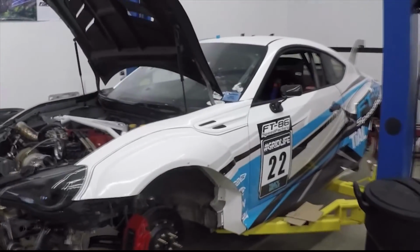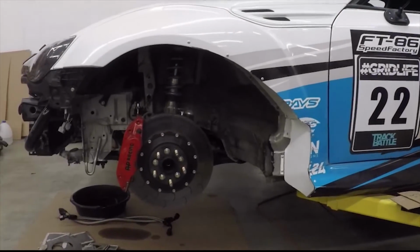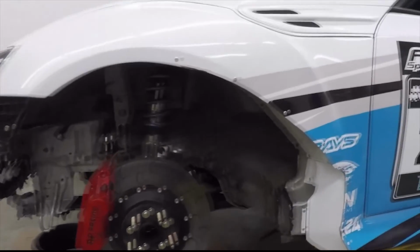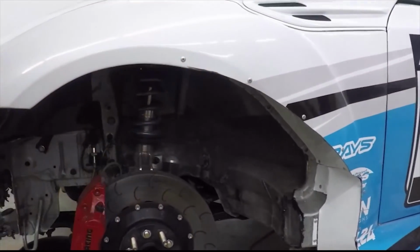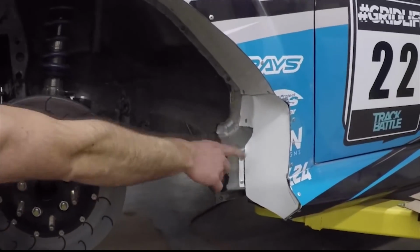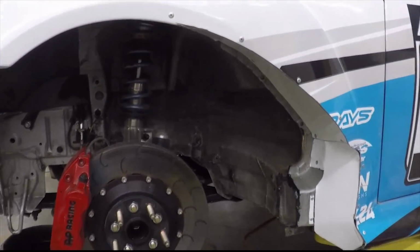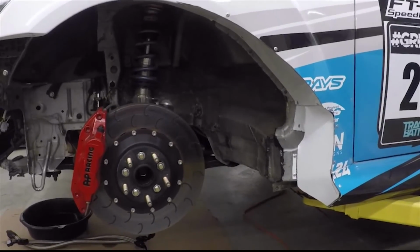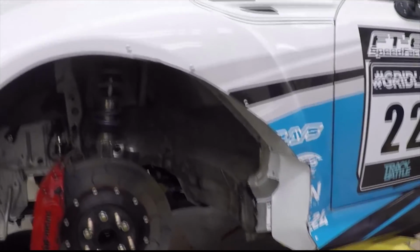Do you have any questions, Clay? Clay's gonna be asking some questions. We talked about it earlier, but my biggest thing is I do like prettiness. Is there anything that we can do to maybe clean up these fender liners a little bit and possibly fill in the little gaps that we have? We'll probably be taking the, not a die grinder, but some sanding discs and cleaning up the cuts from the cutoff wheel. And then we may use some bonding agent similar to this to fill in the gaps and make it a little bit cleaner. But realistically, this was a down and dirty deal. If we were doing a little bit higher budget, we would actually make maybe a carbon fender that actually comes with a fender liner. And obviously the cost goes up significantly there.